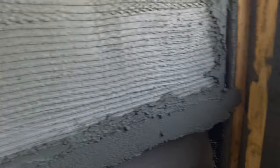But we won't do that until we come around, fill up this wall, and then we'll come back and pop the sticks. All right, so we got this wall here cut, that wall cut. It's all floated. We're not going to do anything with the windows. We're going to just cut off the excess mud a little bit. Not do much there, because when we pop these sticks, we'll fill the sticks. And then we'll tile out to where we need to be. And that gives us a nice edge just to pack with mud, cut it off, stick the tile to it. So instead of wasting time doing these corners and things in the niche and around the window, we'll just start tiling, mud it while we're tiling, and then stick the tile. Saves a lot of time during the prep, and then it gets you exactly where you need to be, and you don't have an instance where, oh, we're out a little bit too far, and now you have to cut mud away or whatnot.